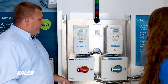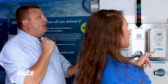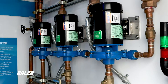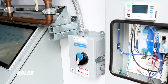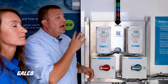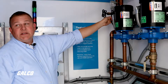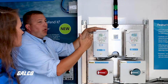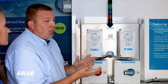What we got here is a drives demo. We're actually simulating a booster pump application. You can see behind you there are actually three pumps. We have two VFDs — two variable frequency drives — and a full voltage across the line motor starter. These are each tied to an individual motor: motor one, motor two, and the starter to motor three. We have one valve to control the pressure and one pressure sensor tied back to this VFD, which is going to control the flow of these pumps and tell the drive and starter to turn on based on demand.